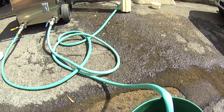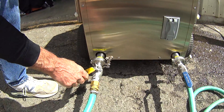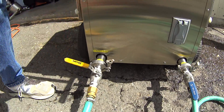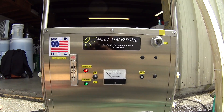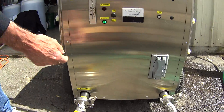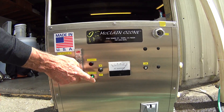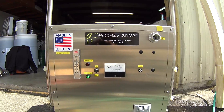The system is set up so that if you turn the water off on the inflow side, the system amperage goes off, the diagnostic light comes back on, and the system goes to standby. Again, if we start the water flowing, the amperage comes on, the operational light stays on, and the diagnostic light turns off.